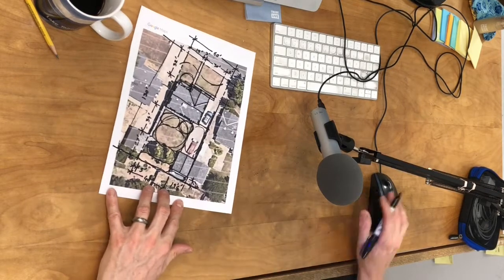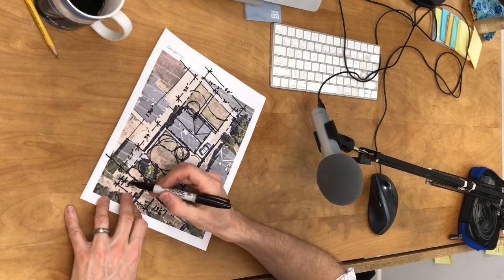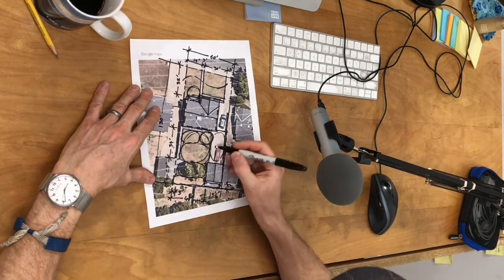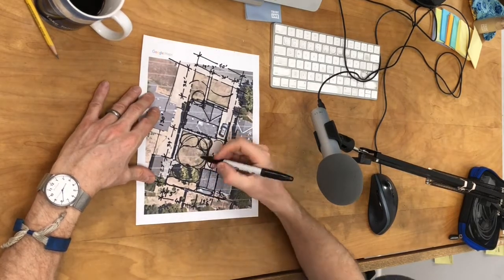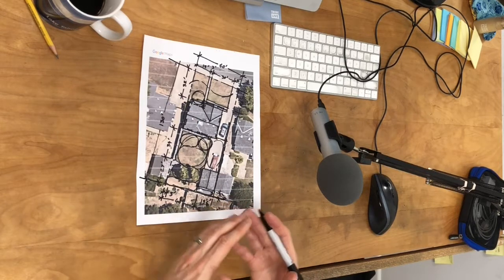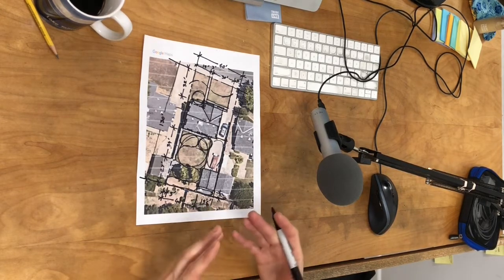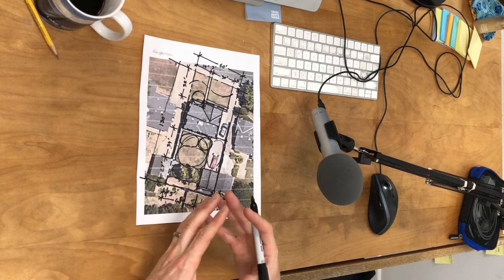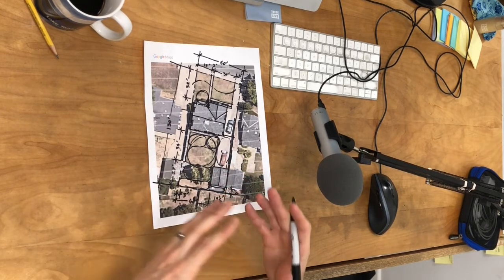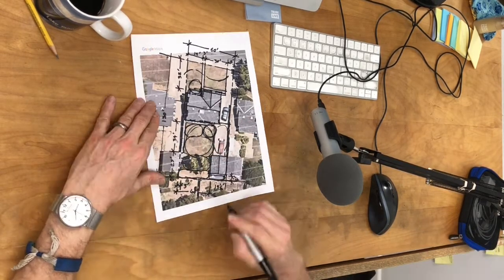The site markup gives you a rough idea of these spaces. You can look at the overall sizing - 40 minus 3 is 37, so if it's roughly 35 by 40 you're looking at something like 1,400 square feet for the whole area. You can use your measuring tool to break these down and look at actual square footages of the different areas you're defining. That way when you go to a materials yard and they ask how many square feet, you can give a good answer - 200 square feet or 1,600 square feet. Outdoor space adds up very quickly, and small differences can become very large in terms of resources needed.